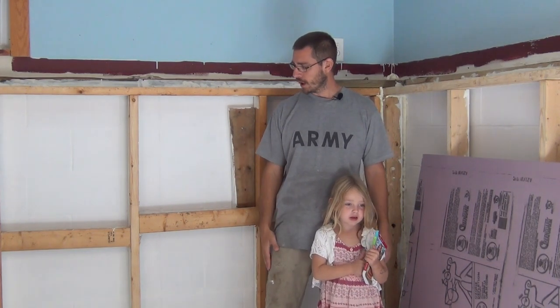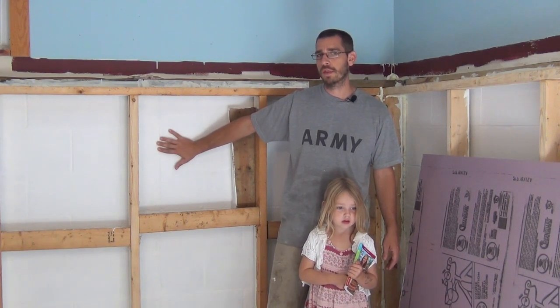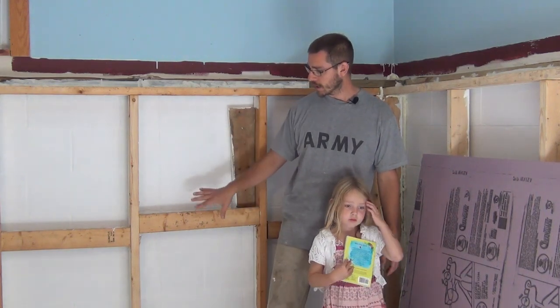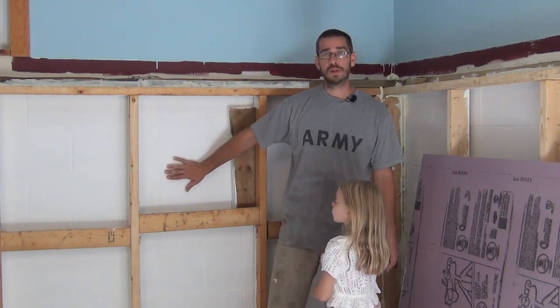So I put two coats of the Drylock Extreme on. Everything should be good to go, and we shouldn't have any moisture coming in. Now, one thing I was a little worried about was a little bit of condensation. The walls do stay a little bit cooler than the inside air here. Obviously, we've got 55 degree soil outside of the walls in the wintertime, and sometimes colder than that through the top levels here. And so I wanted to get a little bit of insulation.